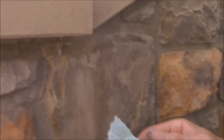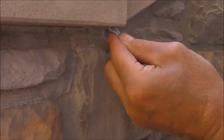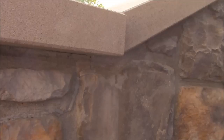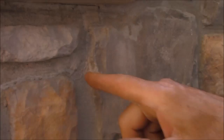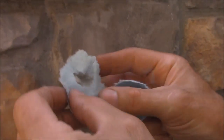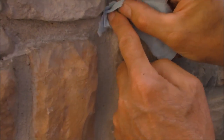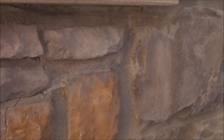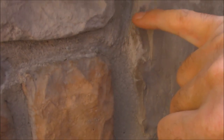I'll show you what's going to happen. I'm going to take very small pieces of paper towel and we're wiping off the excess. If I get that caulk on me, I'm going to make a mess and get it all over the place. We're wiping off the caulk — not letting it smear. As you can see, we've filled the crack. The trick is, as soon as you get a gob of caulk, get rid of it before that gob causes a smear. Wipe up the excess as you work. Only do as much caulking as you can wipe within a minute or two — don't let this lay too long. There's a decent view of the proper way of getting thin caulk into a hairline crack that, when this dries, will be just about invisible.